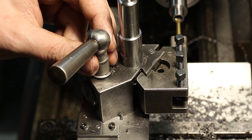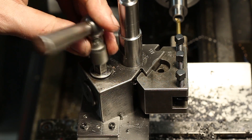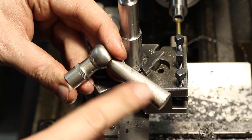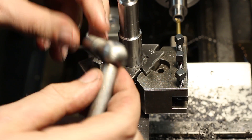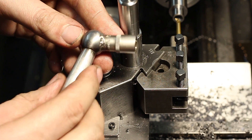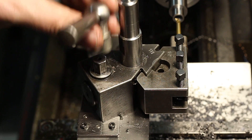A lot of people have commented because I use a wrench on my quick-change tool post, and finally I was annoyed enough by it that I cobbled together a handle. This is redneck engineering at its best — I used an old clamping handle from who-knows-what and a 10 millimeter six-point socket and tack-welded it together with some stainless steel filler rod. While it looks a bit ugly — very ugly in fact — it's exactly the right size. I think I'll keep it.